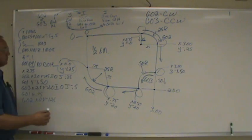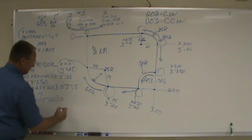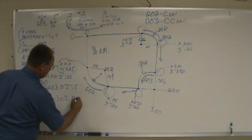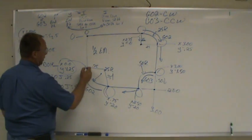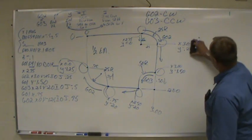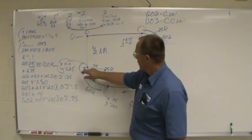I's and J's, start point to center point. I, we didn't change at all again, so once again, I is 0. J went from here to here. This time we went upwards, so that's a positive number. J 0.75. So that's that arc. Now we're sitting over here. I'll go over here to finish up the program. We just got done cutting a clockwise arc, so we've got to go back to G01.